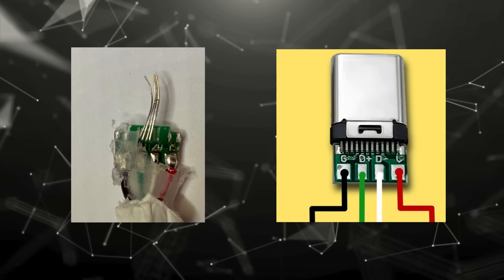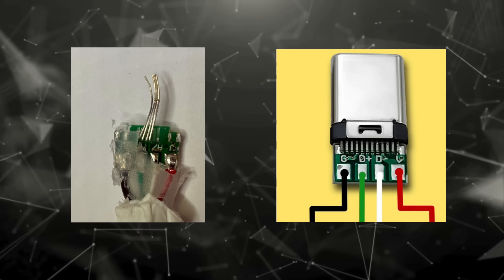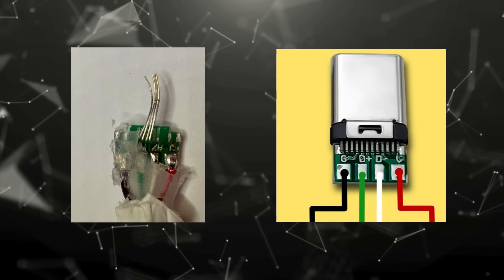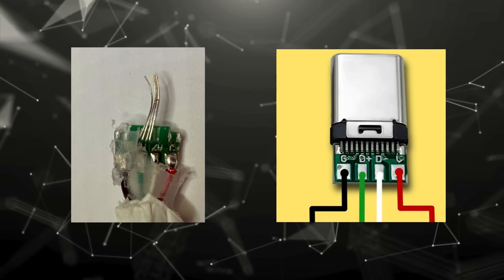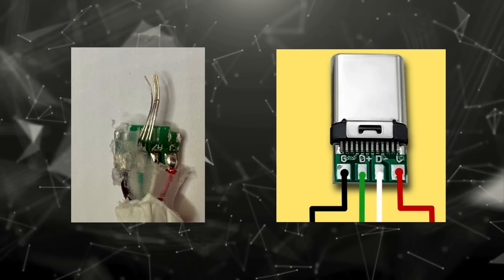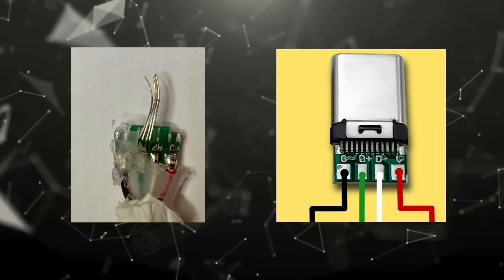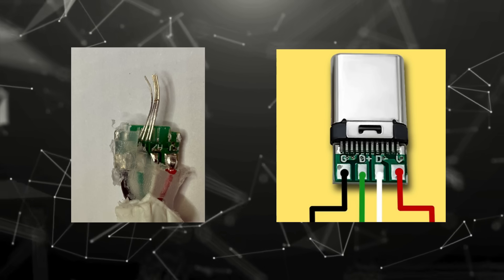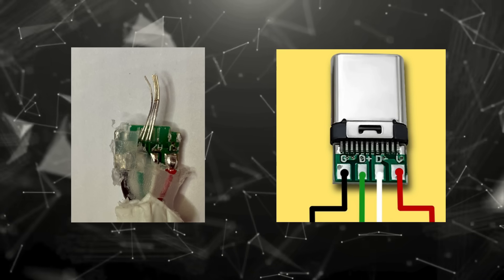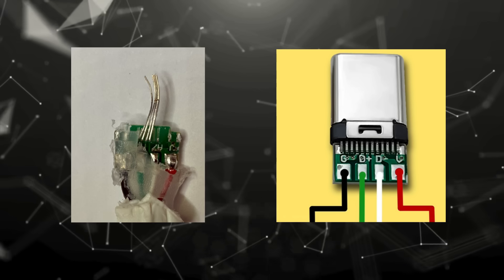Here we can see just four solder pads being used: V-Bus power, the red wire, usually plus 5 volt; the black wire, return path; D-plus and D-minus, the green and white wires, used for USB 2.0 data. The rest of the pins are left unconnected, because this cable only supports charging and USB 2.0 speeds, not full USB-C data transfer. USB-C is symmetrical and reversible, which is why it has so many pins. But for basic charging, the pins are mirrored on each side, so the cable works in either orientation. That's why this cable only connects four wires — the minimum needed to deliver charging and USB 2.0 communication.